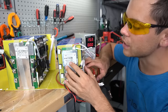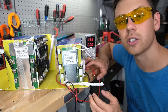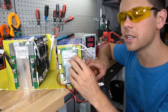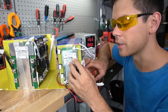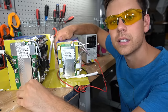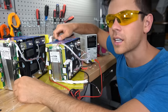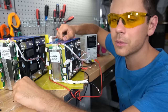So if you do buy one of these, you need to build a system that has a solar charge controller with low temp charging protection, such as a Victron. Or if you live in a warm climate or if you're going to have these indoors, you probably don't have to worry about it. Please understand that if you charge these cells when they're frozen, especially quickly, they'll be permanently damaged forever. Something else I like is that even though these are a significantly different size pack, they're very similar in design — I like the consistency. That just shows that these are professionally built, unlike some battery companies that just throw batteries together with whatever cells or BMS they can find.